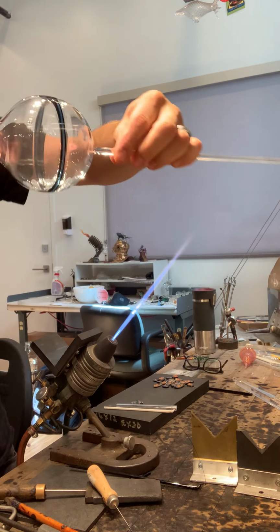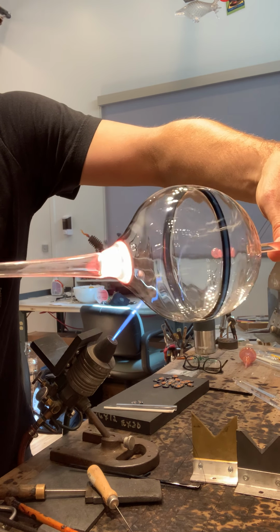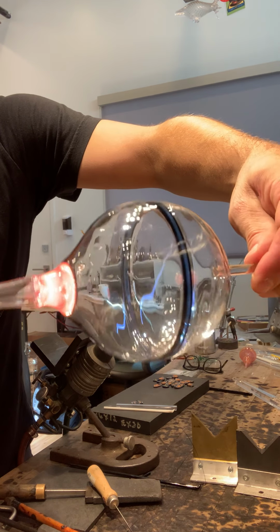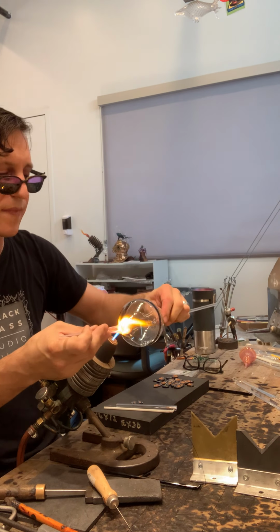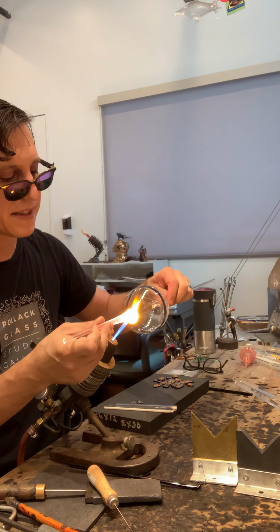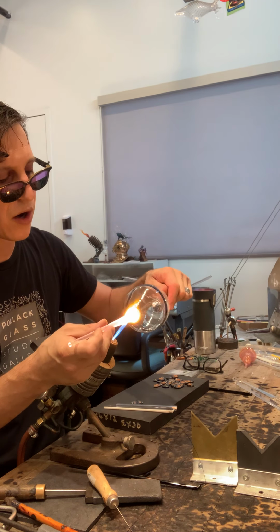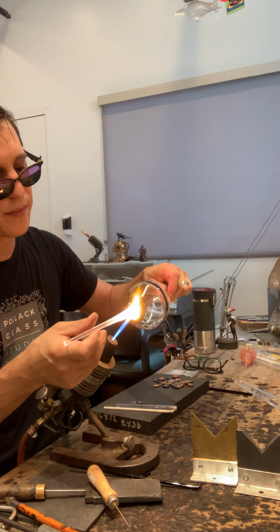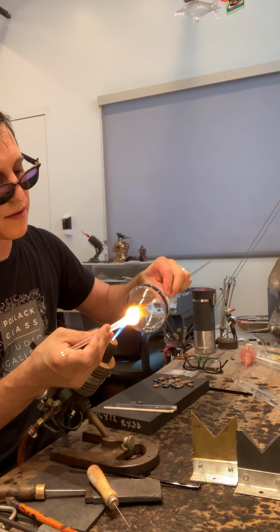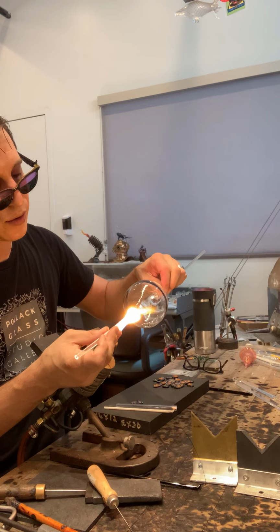So it's thickening up, and it kind of goes into a little bit of an hourglass shape, and then it seals. It becomes solid. And you'll have a little sharp peak inside there, and you want to melt it till that's gone. They call that the dome of doom. And if it's a sharp point going into your bubble, going into your solid hook, it can lead to a crack.